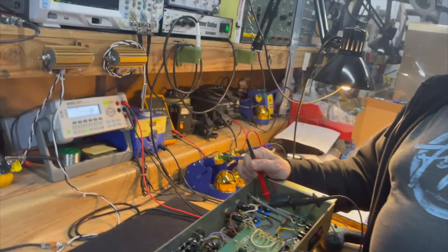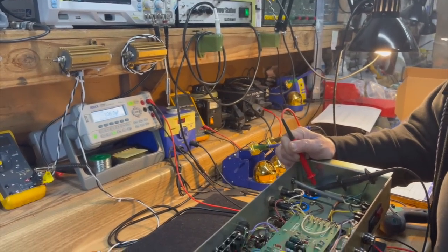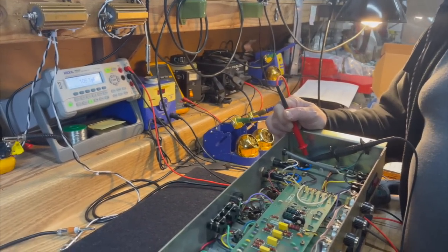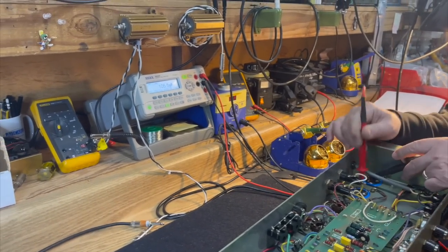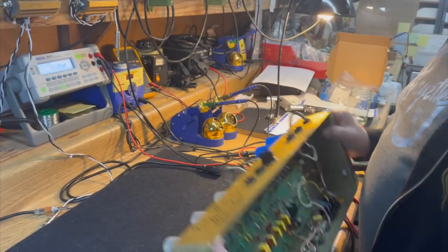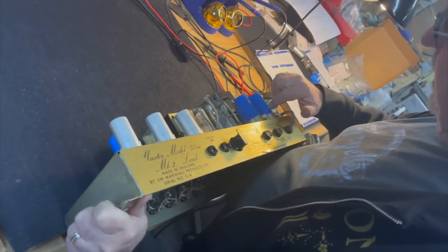Because you certainly just don't arbitrarily replace capacitors that are reading good. And the first thing you do is just put them on a capacitor tester. So here's the main filter cap over here where each one of these is a 50 mic. And let me verify that. 50, usually 50 mic at what, 500 volts? Yeah, a dual 50 at 5.